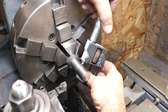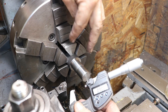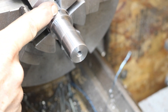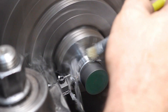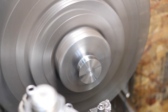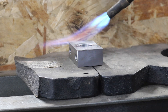875.5 — that's perfect, 875 was the target. Over here we're looking at 900 for the target; it went just a smidge over, but I'm press-fitting with a little warm-up of the block and it will go right on. We got our hole in there and I'll take it out, flip it around, and part this off. I'm going to warm this up a little bit to make it go in there a little bit easier.